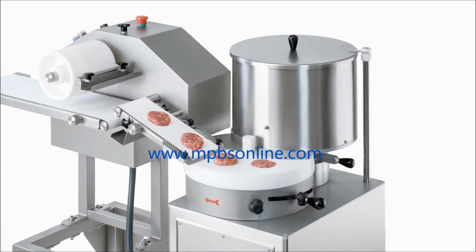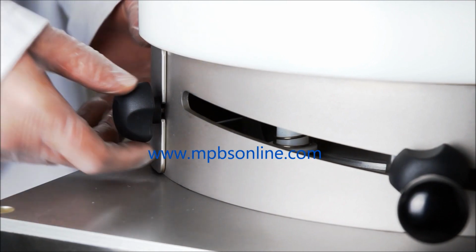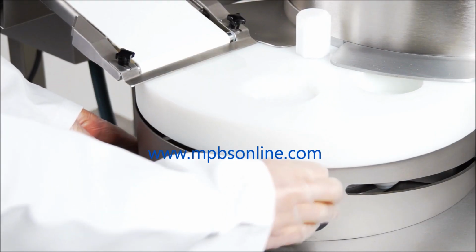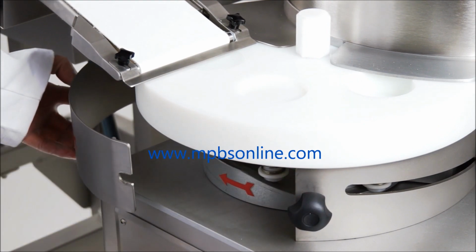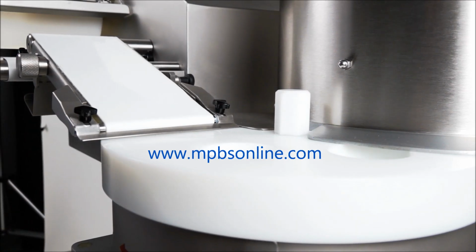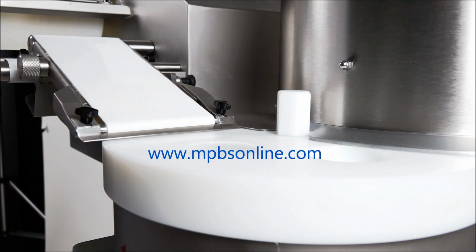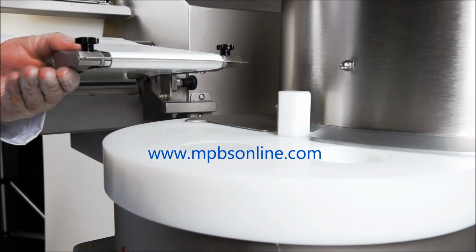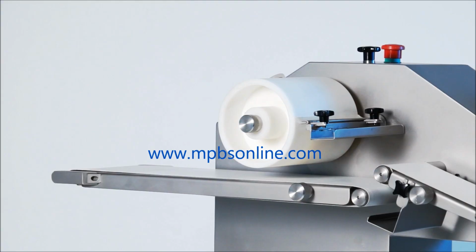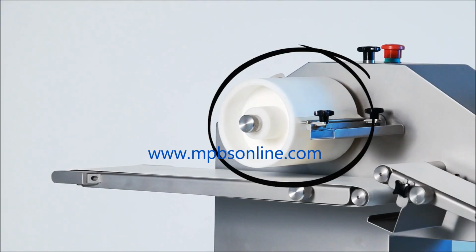The second is located in the lower part of the dispenser plate, situated on the protective cover of the ejectors. This prevents the ejectors from being handled manually. And the third is found on the meat portion extractor belt, which automatically stops the machine if it is in the vertical position, thus preventing fingers from being trapped. And for maximum security, the roller has a spring which prevents hands from becoming trapped.